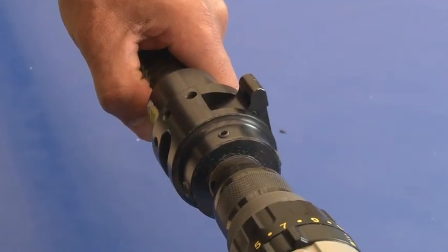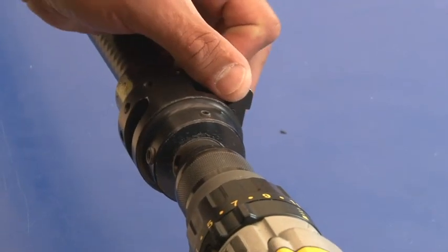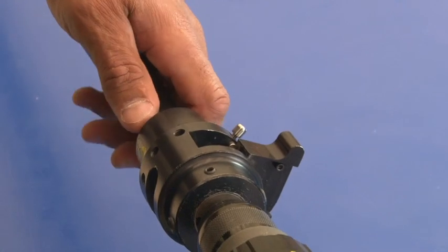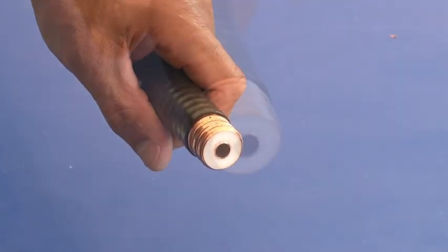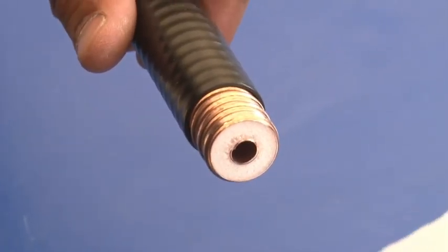When the blade lever is shown fully closed, open the lever and lock with the pin. Remove the tool. Make sure the remaining cable is removed from the tool. Use an alcohol wipe included with the connector to clean the outer conductor thoroughly.